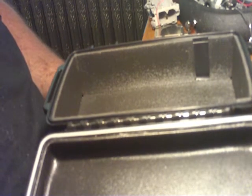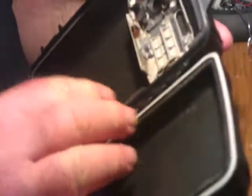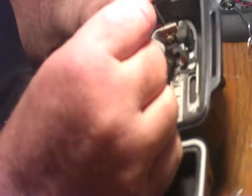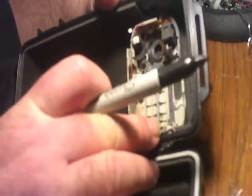What I'm going to do is mark my holes out where I want to drill for my P41. I have a front cover, and I just put that cover in there. All I'm going to do is mark the center of my flash and the center of my lens. I could print out a template for this camera, but I kind of like doing it this way because I know exactly where my camera is going to sit. With a template you're not always sure.